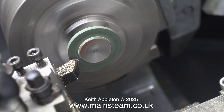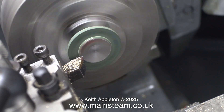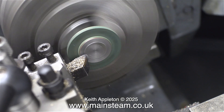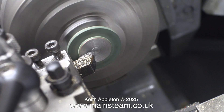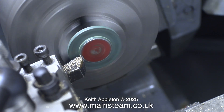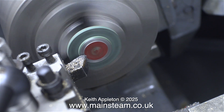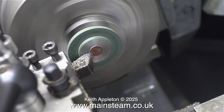This doesn't feel right — it does not feel like machining cast iron. And the finish I got was diabolical. I changed the lathe speed but all to no avail; I still could not get a good finish. Look at this — it's horrible. I changed the spindle speed, took a deeper cut, then changed the spindle speed again and took a lighter cut. But I could not get it any better. I'm now doing the other one and it's the same. What terrible pieces of metal these are.